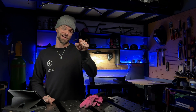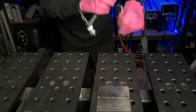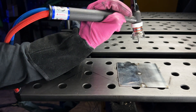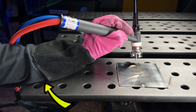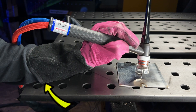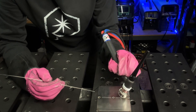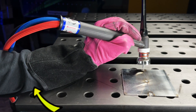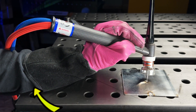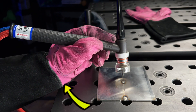Here is what I suggest instead. Move your workpiece away from the edge of the table a little bit further. Then position yourself with your forearm comfortable on the table. You can now see that you can move further with your range of motion as you pivot. Doing it like this, there is no need to start sliding. Getting set up this way, you're going to be able to see much more clearly. Sometimes getting set up with just your hand or wrist anchored is going to restrict vision, especially as you start to become uncomfortable while traveling.